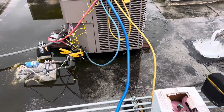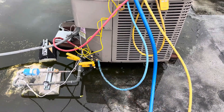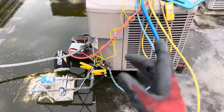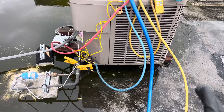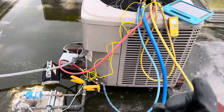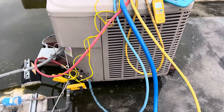Quick rundown on a kind of emergency Saturday — freezing coil inside, no air filter, about three feet of 18 or 20 inch duct on a five-ton unit. Straight shot, you could see the coil with no filter in there. So there's no restriction other than that small 18 or 20 inch, but at least it's a straight shot — only a few feet. The supply is big enough and the short route won't cause an issue.